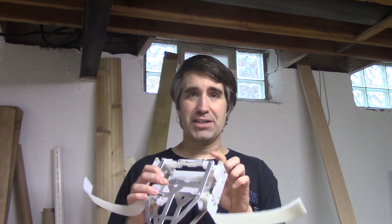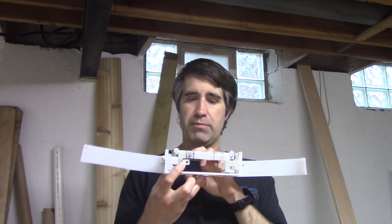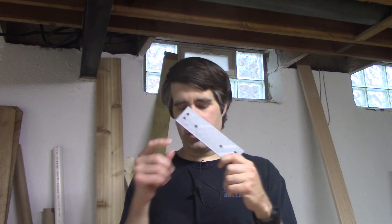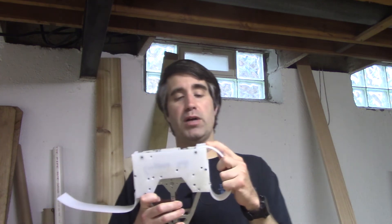Now the downside of building this all by hand is there's a little bit of slop in your build process — sometimes a lot of slop, as I'm looking at right here. This little bracket right here is off by about an eighth of an inch, which means the 3D printed template was off, which means my machined pieces based on those 3D printed templates are off. I need to adjust this piece to factor in this problem. Actually, screw it — I'm just going to get rid of those brackets. They save a few grams. I really don't think I need them because I've got four more bolts here. Granted, they also hold on the bumpers, which tend to get ripped off, but screw it. Problem solved.